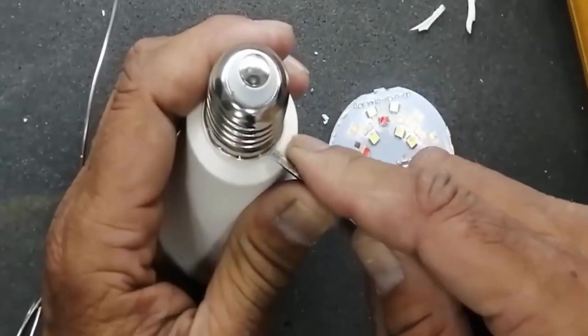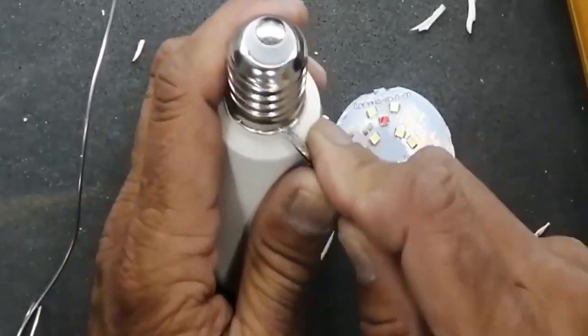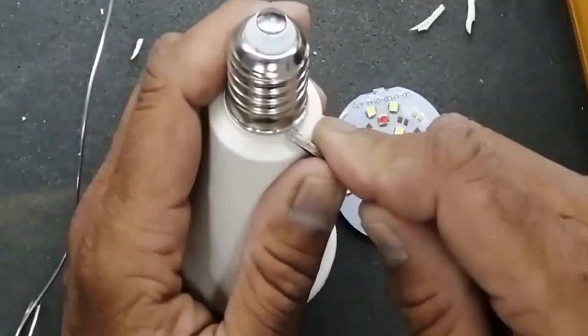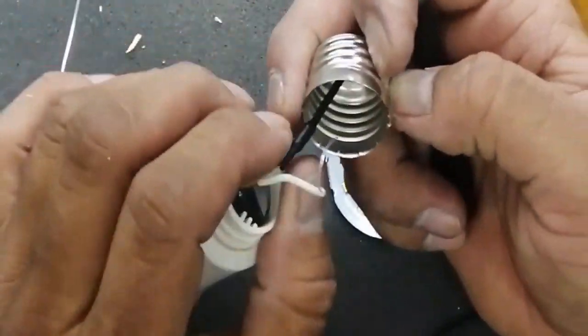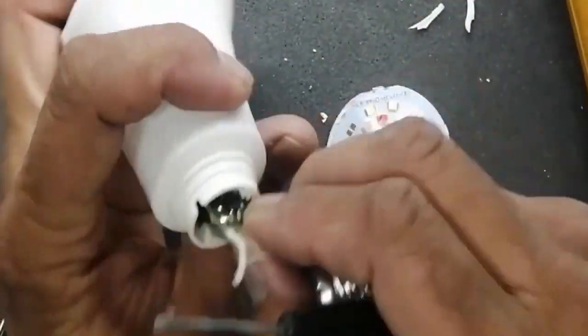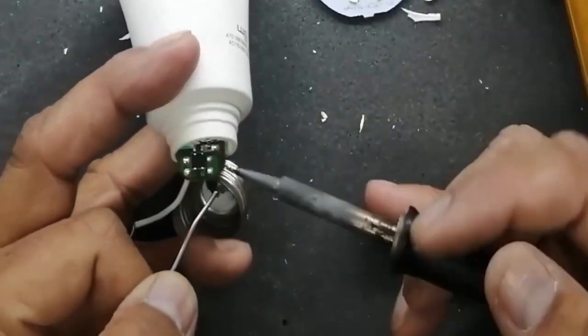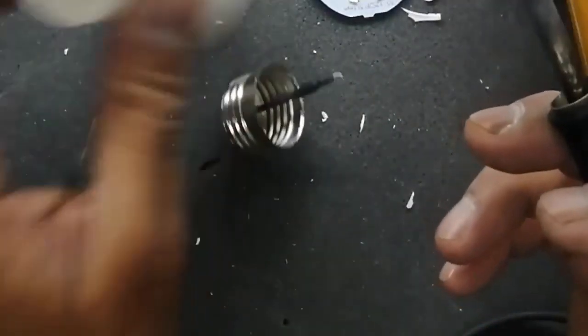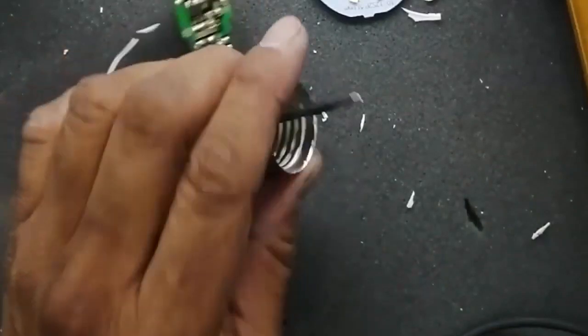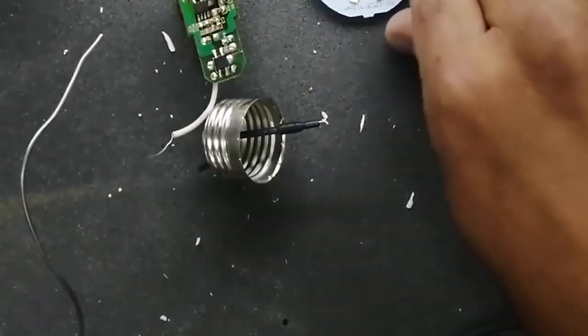Actually, what happens? This power supply circuit takes 220 volt from our line voltage. Now I will separate this holder connector carefully using a sharp knife. We will remove this. There are two wires. One wire is connected to the input terminal with a fuse resistor. This is the fuse resistor. I will demonstrate how to test this fuse resistor.